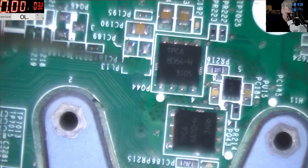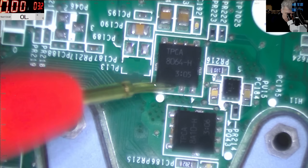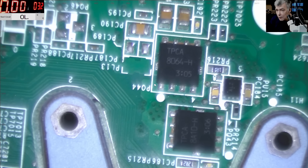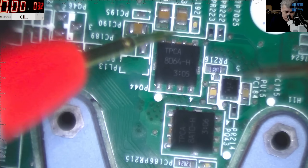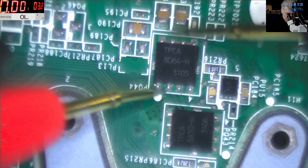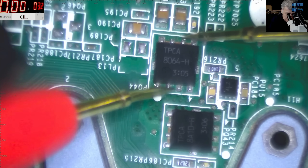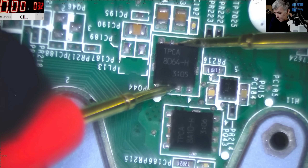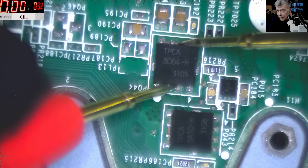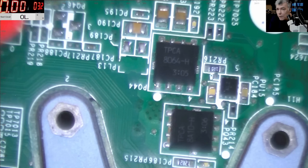So one more time: you have four pins together and three pins together, and then the gate. Usually the MOSFET gets shorted between source and drain. On this case source and drain doesn't matter - just check those three or four pins. People are testing like that, and on the multimeter in diode mode you can see zero - infinite resistance.